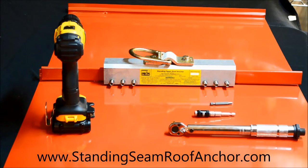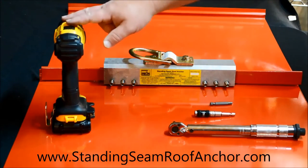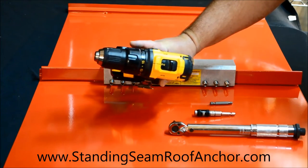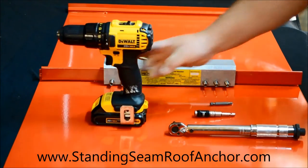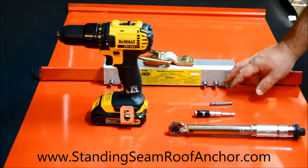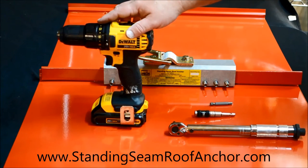So basically, once we have it in place, it's about a 2-minute installation. The first step is we're going to snug up these six set screws with the screw gun. I know on my personal screw gun with this clutch that with it set on the highest clutch rating of 15, that still puts me at about 75 or 80 inch pounds. So we're going to be torquing these cup tip set screws today to 90 inch pounds. So I know I can be on a setting of 15.